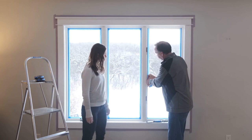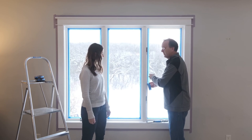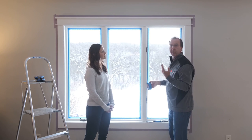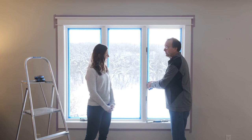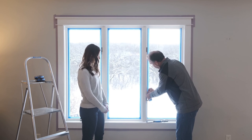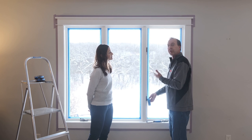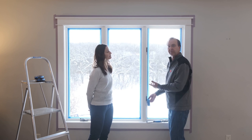Yeah, rough surfaces are a great example. That's a surface where you're going to need a little bit higher level of adhesion, a little bit heavier backing, or delicate surfaces like we have right over here on the drywall. Painted surfaces require a little bit more delicate adhesive so you don't damage it upon removal. And why wouldn't I use just a basic tan masking tape? Well, the long-term removability is great for a project like this and the exposure to sunlight. A tan tape isn't going to give you that great UV resistance — it's going to have a shorter removal time. So this is really a perfect application for the multi-use 2090 Original.